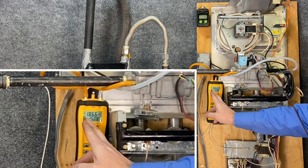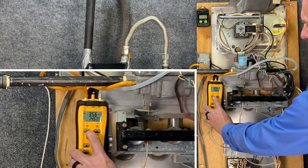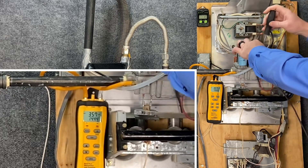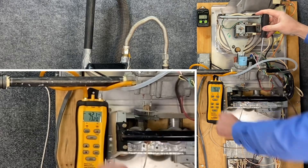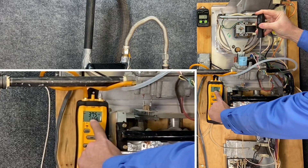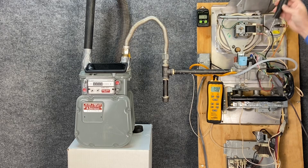My gas furnace shows an input rating of 19 inches of water column — that's really too high for any situation we'll be working with. I'm going to switch to P2, which is my output pressure rating, or what we call the manifold pressure. It's giving me the pressure at the manifold. To adjust it, I take the adjustment cap off the top, then use a screwdriver — screwing it in increases gas pressure and we can see the pressure rise. At 4 inches of water column, I can back it out to decrease pressure, and now we're at 3.5 inches of water column.